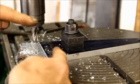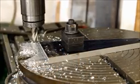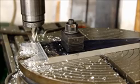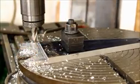It doesn't really matter. You don't want to come too close. So you want to keep it looking like it's 8 mil all the way through. As you said, it is a bit tricky because you've got this thing clamping it down, so you can't just machine the whole thing in one go. But no matter, we can sort that out.